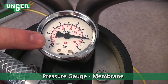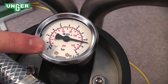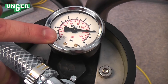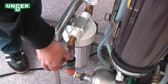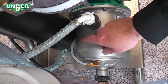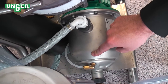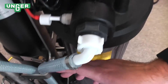At the top, there's another water pressure meter, and this pressure meter shows the amount of water pressure in the membrane. Right now it's at 8.5 bar. Ideally, you want that to be between 8 and 10 bar. If the water pressure in the membrane goes over 10 bar, you can adjust that using the valve at the very beginning of the system. The water is then pressed through the membrane, and at the very bottom, there are three hoses that come out. One is the concentrate that goes directly to the backside. The second goes directly into the pump to be recirculated into the system, and the third is your clean water that's now coming out of the membrane and traveling up into your resin filter.